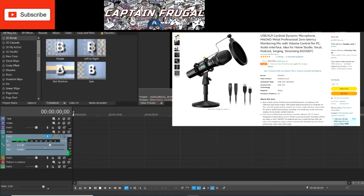Now I'm testing the microphone we're reviewing. The output isn't quite as high, but that's not unusual when using a mic without phantom power compared to a condenser. You're also hearing some computer noise — you can easily key that out with a little audio editing. I recommend recording about 10 seconds of just computer noise and using your software to filter it out. This is the mic we're actually reviewing.